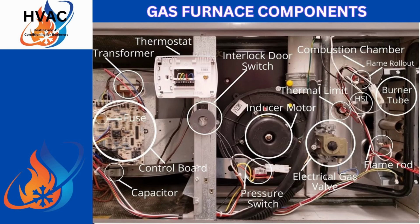Back in the day, old thermostats used to use a flame sensor and thermocouple, where you would have to go in there, turn the gas valve on, push down on the gas valve, light the burner, hold it for a few seconds, 30 seconds, then rotate it over to hold, and the burner would hold, and it would put a slight little flame across the thermocouple, which allows heat transferred into electricity into the gas valve to keep it open. And nowadays, we don't have those anymore.